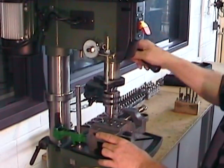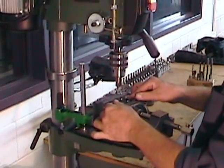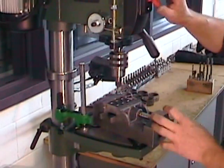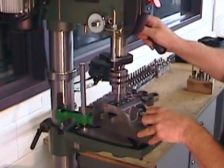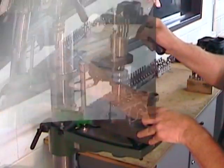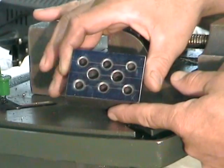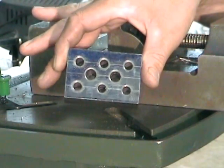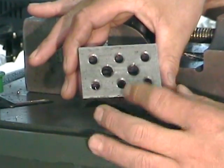Once I've completed my two chamfers on my 11mm holes on this side of the part, I can flip it over without changing any depth settings and do the two holes on the other side. And there you have it, 16 chamfered holes, chamfered at a constant depth regardless of their hole diameter. Exactly the kind of attention to detail you'd expect from a professional craftsperson.